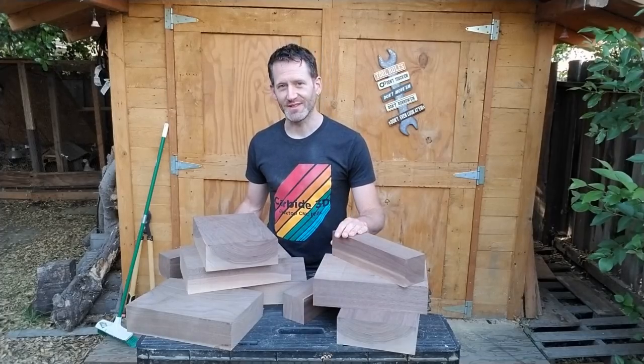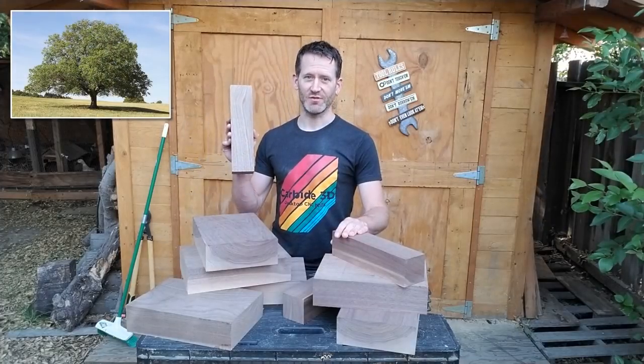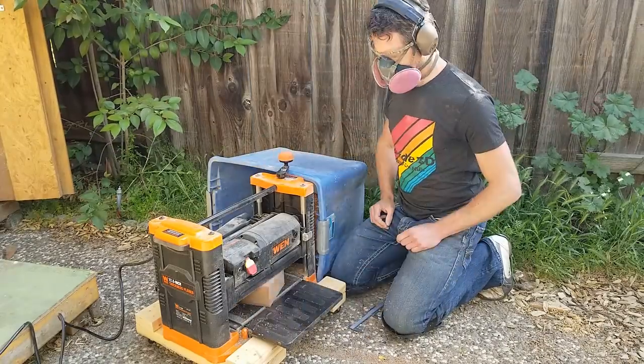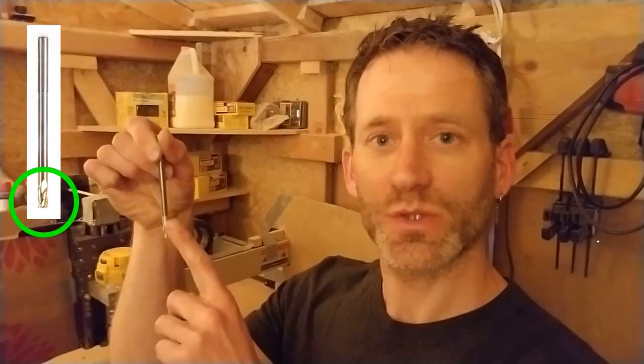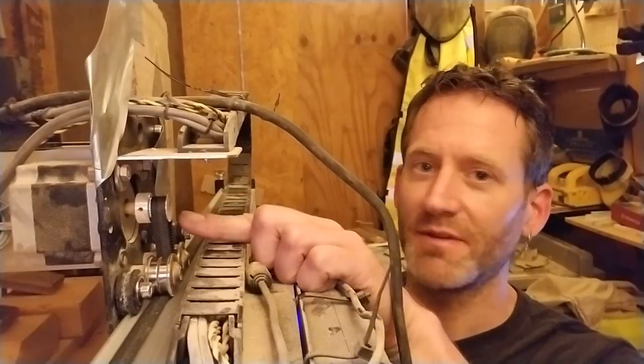The first batch of wood has arrived. Since dinosaur skeletons in museums are always dark brown, I opted for black walnut to carve the bones. I'll start with the skull. I used a bandsaw to cut the stock to size and a planer to give each piece the right thickness, then clamped the stock onto the spoilboard. My experience with thick stock is that sawdust clogs up deep narrow grooves, and since these extra-long router bits are only spiraled at the very tip, the sawdust doesn't get cleared from these grooves and pushes against the shaft, preventing the bit from traveling all the way into the corners, causing the belt to slip and ruining everything. So I'll clear as much stock material around the 3D shape before starting the roughing pass.